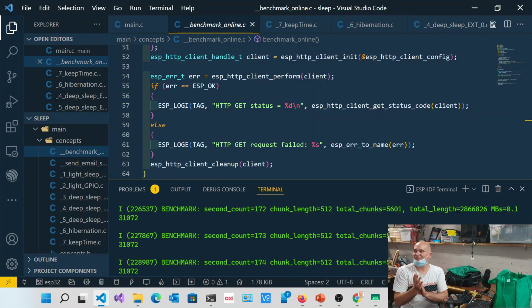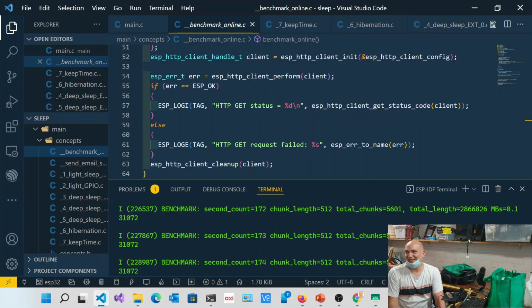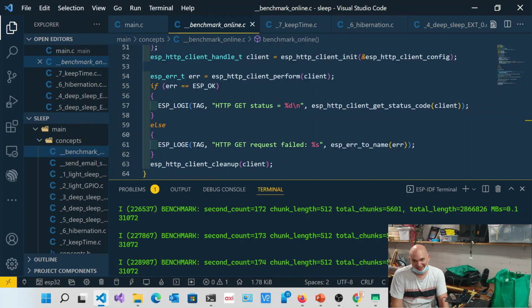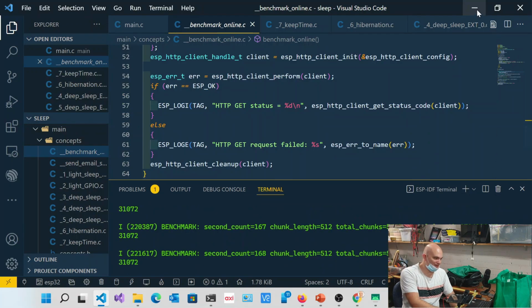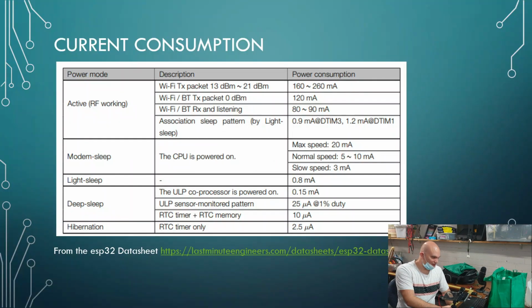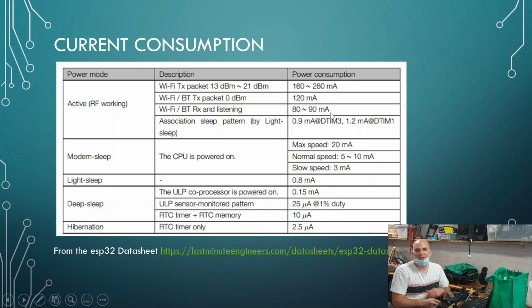This was a big thing that I actually had with guys that I was working with. They read the data sheets of the ESP32, and they misread 20 megabits per second as 20 megabytes per second. And I'm like, dude, there is no way in hell you're going to get 20 megabytes per second, and it's very unlikely you're going to get 20 megabits per second. That's ideal conditions. That's raw data, with no TCP/IP stack, and that's essentially in a Faraday cage. I can push that up to 6 megabits per second if I increase the speed, if I give the Wi-Fi more memory. But what you see in the data sheets, you've got to realize that they're doing that in a perfect condition in a lab. This is essentially what you could typically expect. And this applies to this as well. All right, so now we're talking about with no connectivity.